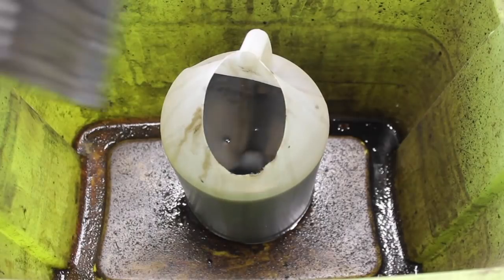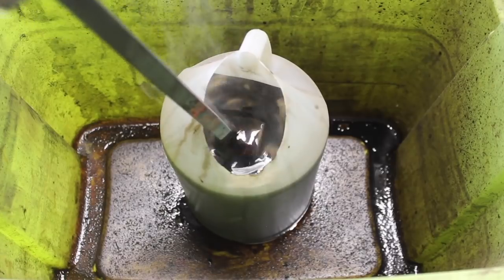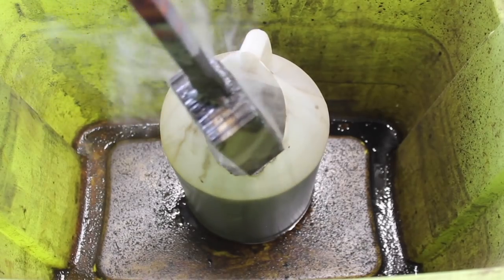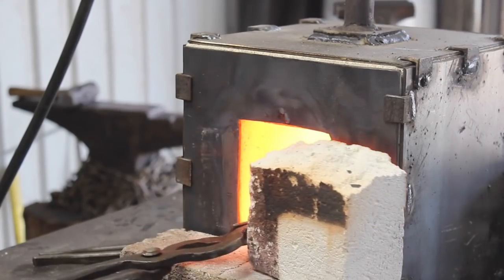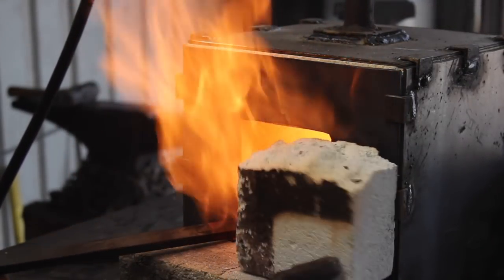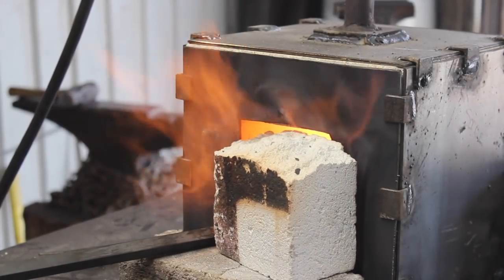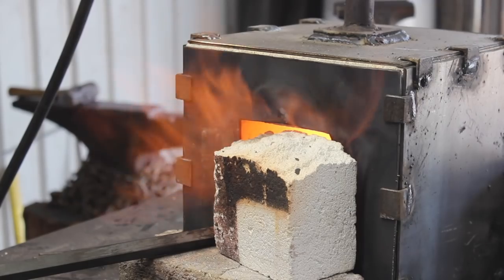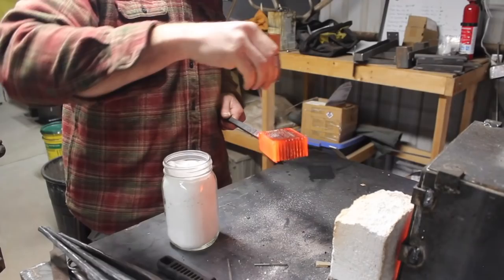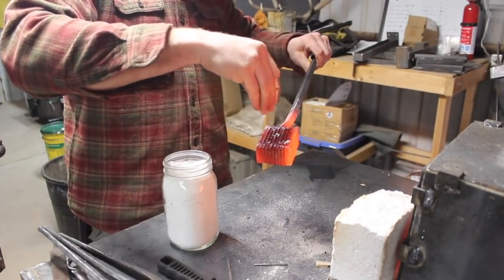And go ahead and dip it in the old diesel. Get some hydrocarbon goodness here. Protect the surface of the steel a little bit, and leave behind some carbon deposits, which helps with the forge weld. Brings the necessary forge weld temperature down a little bit. You really can forge weld with just diesel or some similar product, provided your billet's nice and tight and your forge atmosphere is at least neutral or carburizing.